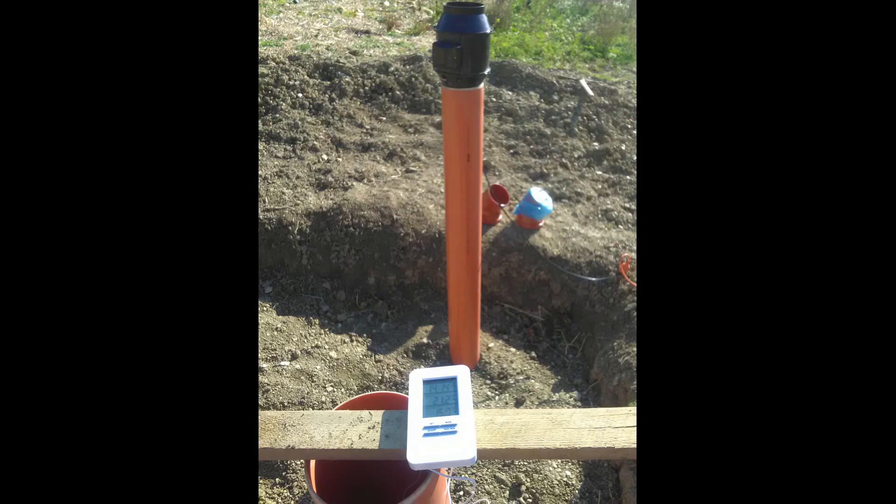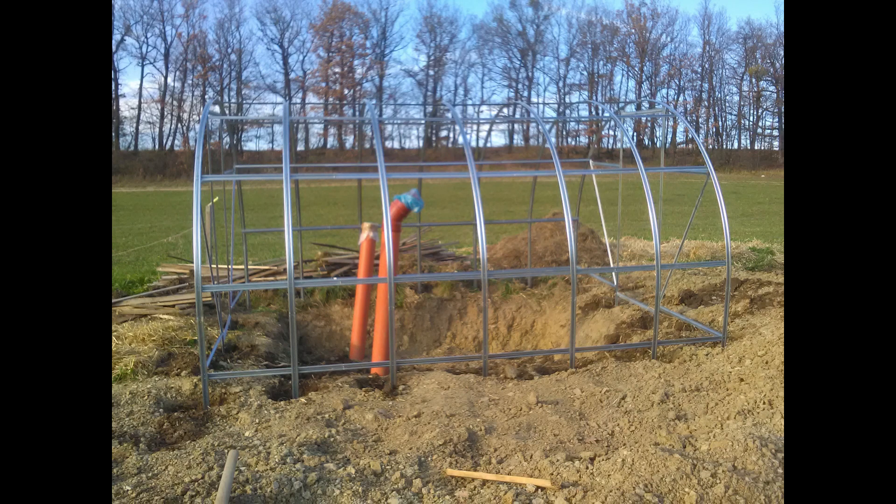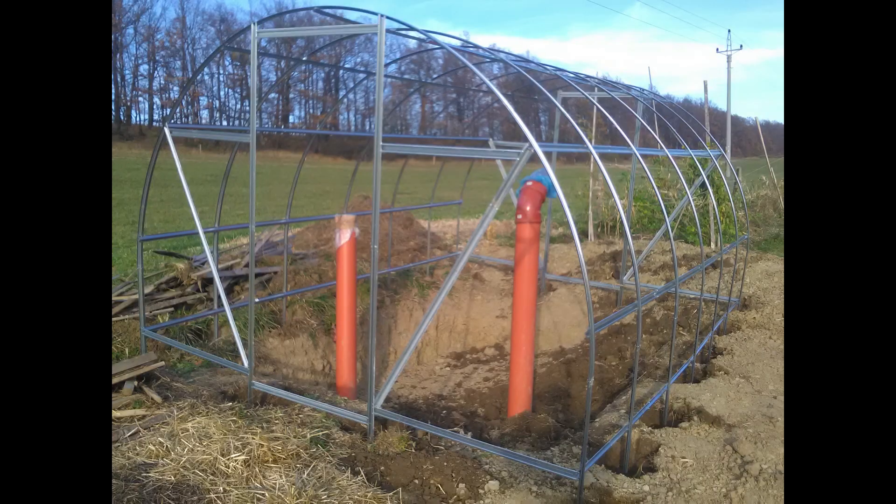This system fits a greenhouse of 12 square meters with 18 cubic meters of capacity. The idea is to circulate the whole air of the greenhouse at least 20 times an hour, and by using the VENT with airflow of 550 cubic meters per hour we achieve exchange 30 times per hour. There will be some static pressure loss, so being conservative I say this system has exchange capacity at least 25 times per hour. I have no meters to measure it precisely, but I don't need to.